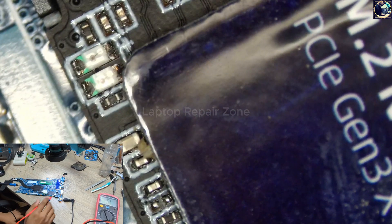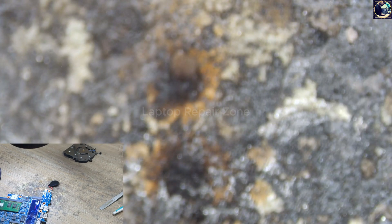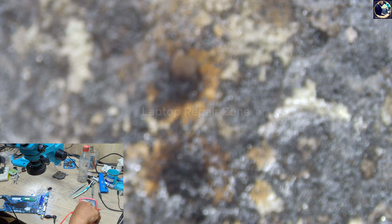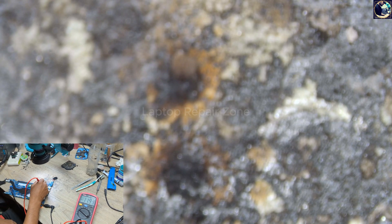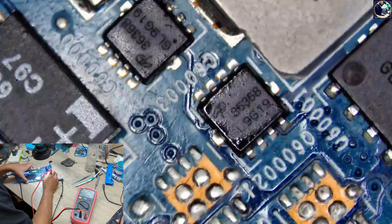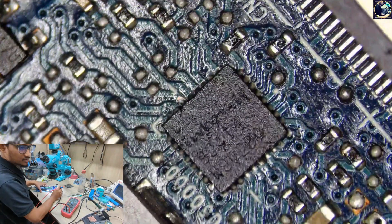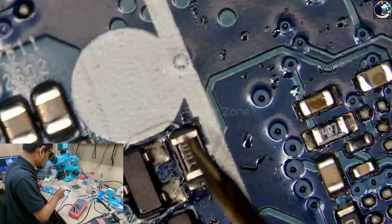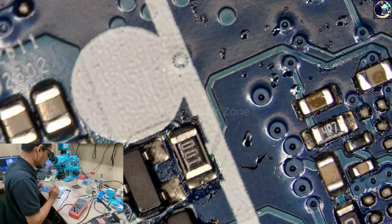It's taking normal amps in off condition — that's good. There is still the orange LED glowing. If I check 12 volts, as you can see we have 11.93 volts — almost 12, that's perfect. Let's check pin number 17 — 19.12 volts. Also, let's check this resistor: 19 volts on one side, 19 volts on the other side. Perfect.